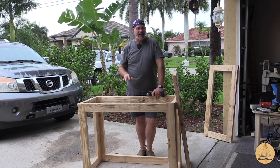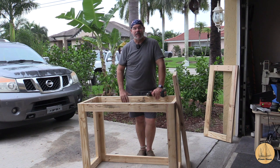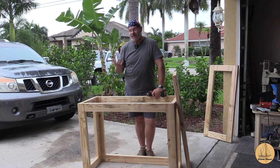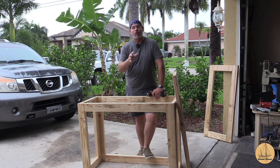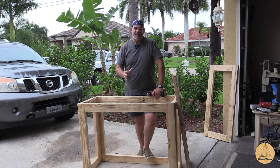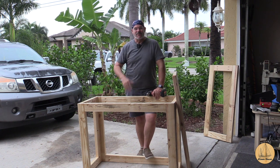And we're going to be using a cement infused siding. You might have heard it as a hardy siding or hardy plank. I think that's one of the brand names, at least here in the US, that is used. But it is very solid, very heavy, very waterproof. And frankly, it's going to aesthetically look and match our house. So it's going to look like it blends in. The nice thing about it is they have one that has a pre-printed pattern of stucco right on it. So that saves me a lot of time and helps reduce me needing the stucco over this thing.